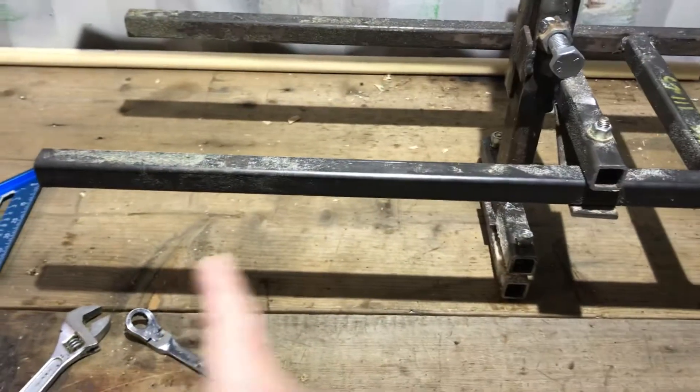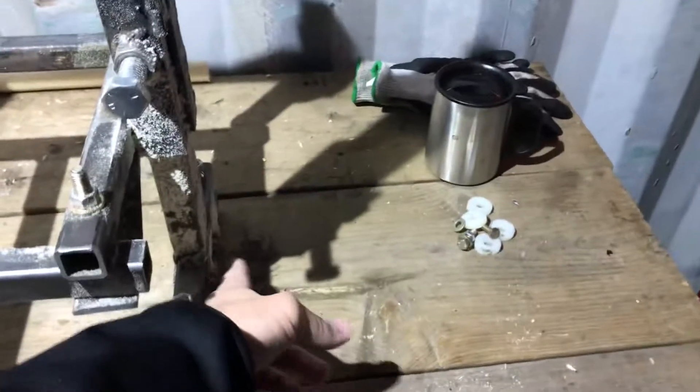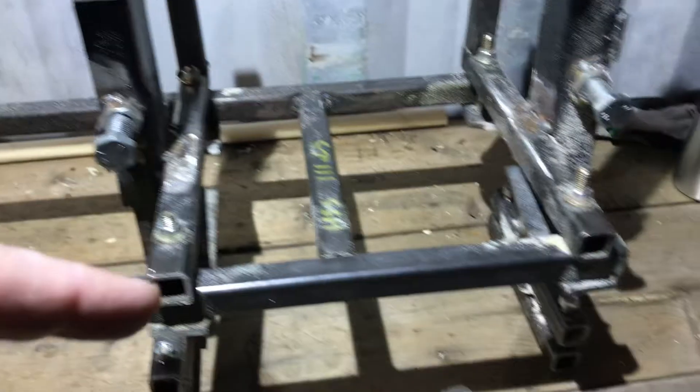These two pieces, which you can modify, are 30 inches long. The usable length will be about 26 to 28 inches total — you lose two inches here and two inches there. On the bar you have to mount a couple inches, an inch or two from the chainsaw, and on the tip you can't be right on the tip or you'll blow that pocket.